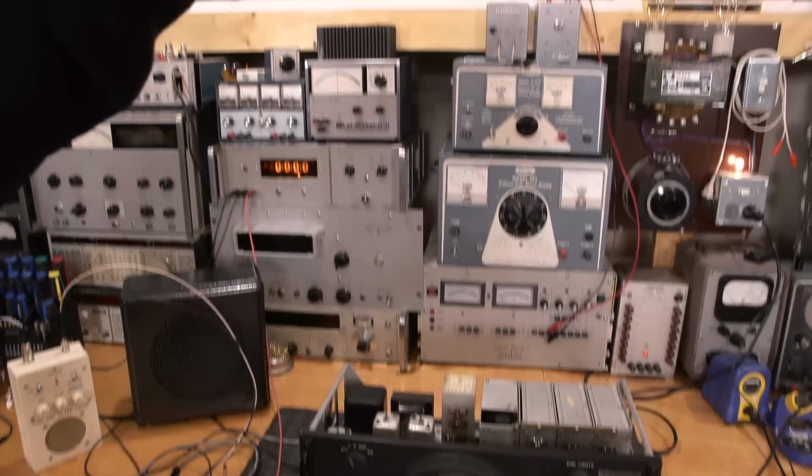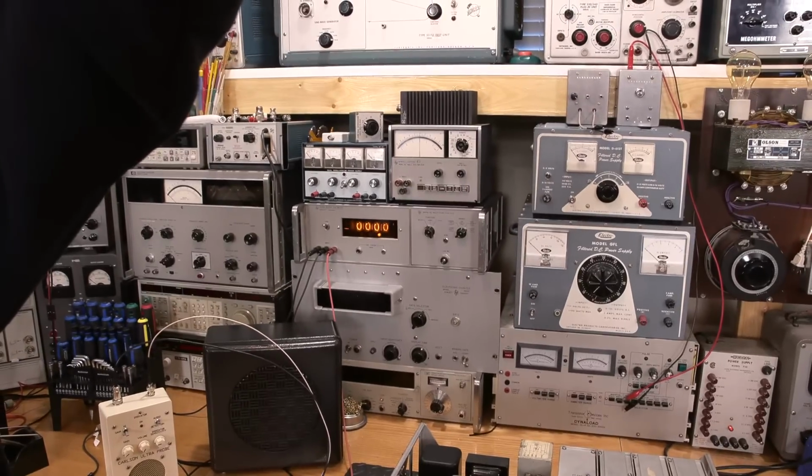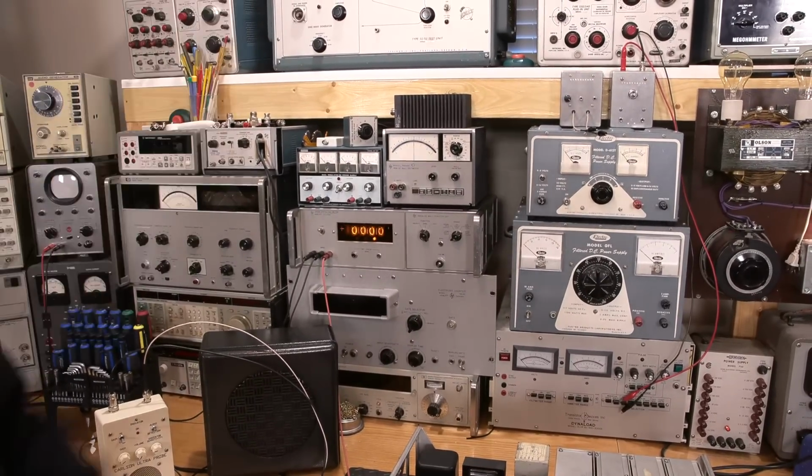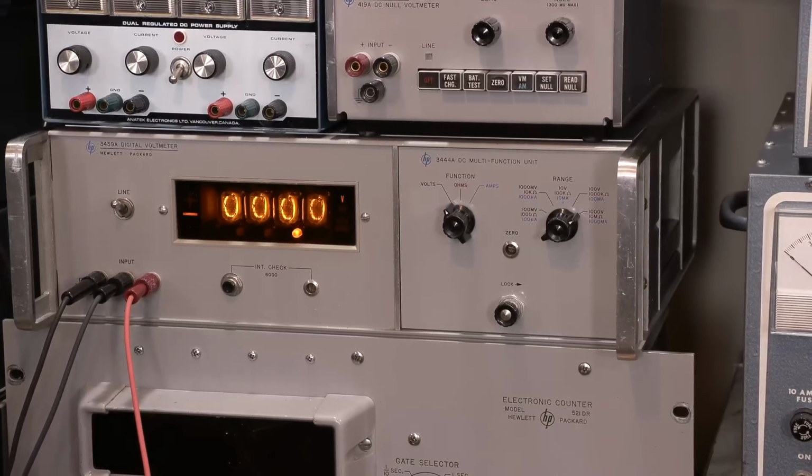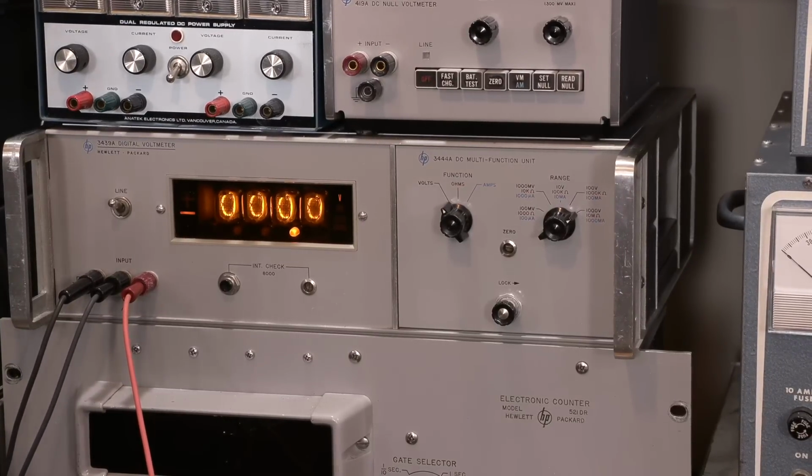All right, so the voltage there should be about 200 to 210 or something like that. So what I'll do is I'll zoom you into the meter here so you can see that for those of you with smaller devices. So this is the power supply side. So it is definitely low. We should have about 200 on the plate of the tube, so I expect to see a drop on the other side. So let's read the other side of the transformer. Yeah, 172. So that is quite a bit lower.